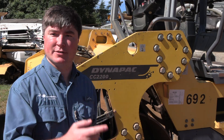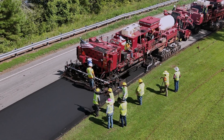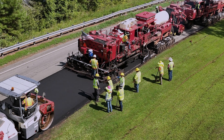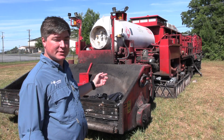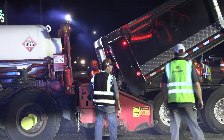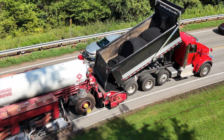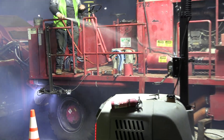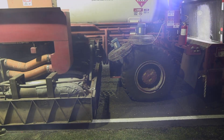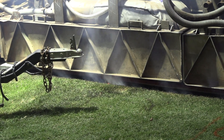It'd be a good time for us to go see the equipment. There are about seven or eight pieces of equipment that are key to the operation. This is the recycling repair machine. Here we see the first step where the asphalt is actually dumped out of the dump truck into the preheater and conveyed back to the next piece in the chain. At the bottom are heat shields for the propane-based heater that they're using to get the asphalt up to about 250 degrees so it's pliable enough to scarify and recycle.